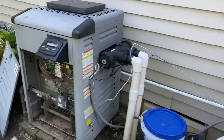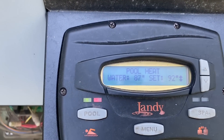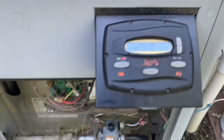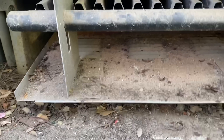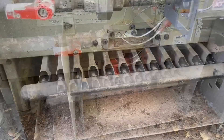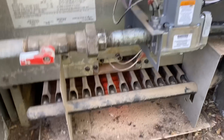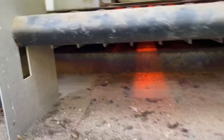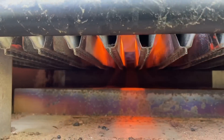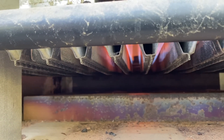Heater power is back on. We have a call for heat — the red light is on for pool. My temperature is 87 and it's set to 92. I'm waiting for that glow. We have our glow. Waiting for the gas valve to energize and see what kind of flame we get — putting the camera down there for a good view. And Houston, we have ignition! Look at that. Houston, we have ignition. Beautiful.